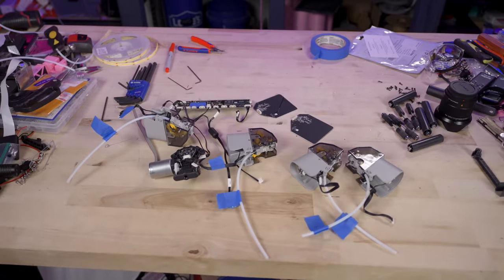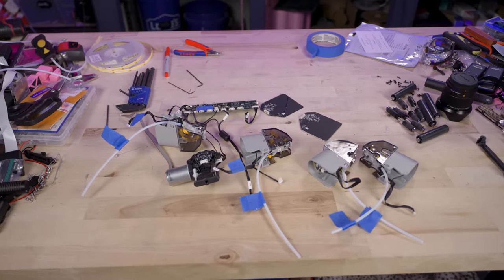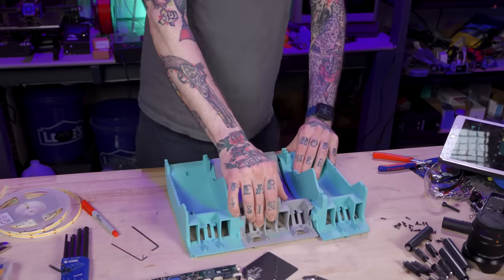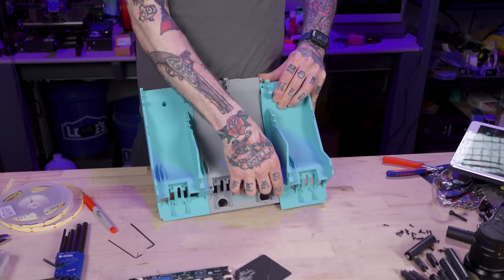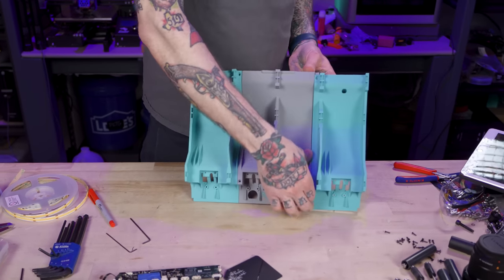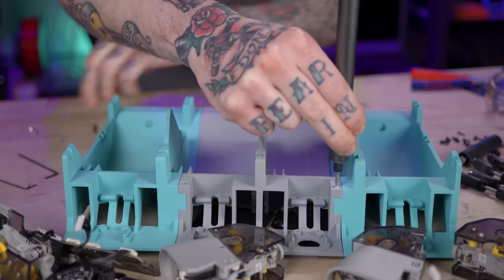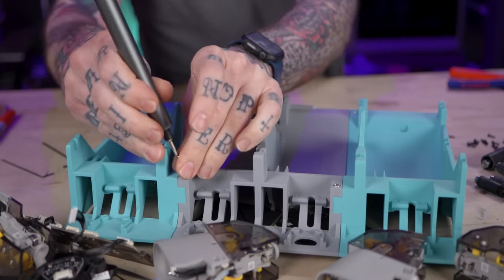Once I got the shell stripped down to just the base components of the AMS that I actually need, it's really pretty straightforward. Assembling the three parts of the Hydra into one is as simple as slipping together a couple of dovetail joints. It actually pretty firmly attaches together, but then a couple of M3x20 screws go in place to ensure that they are properly aligned and won't come apart.